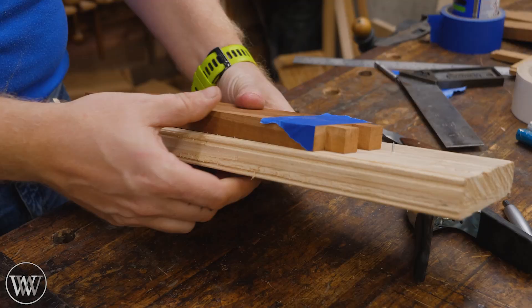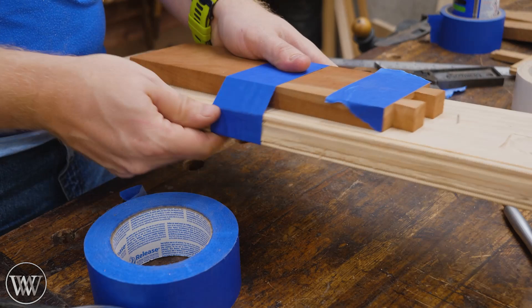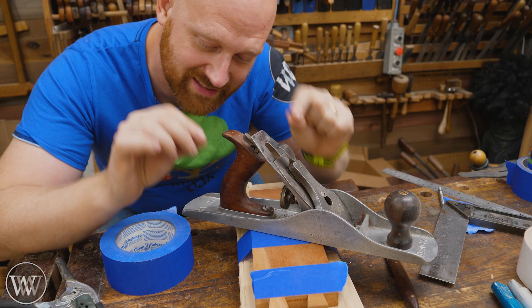I've had a few times where I wanted to glue two pieces of wood together and my squeeze clamps aren't quite big enough to get all the way across, and I don't need a huge amount of clamping force. In that case, it's amazing how much clamping force you can get with blue tape — it's got a little bit of stretch and you can pull it down, and for a lot of applications that's all the force you need, especially for organic shapes like totes, handles, and saws. Sometimes just putting a little bit of epoxy and some tape on there is great — you don't need a lot of clamping pressure with epoxy, you just need it held in the exact spot, and tape can really get you that.